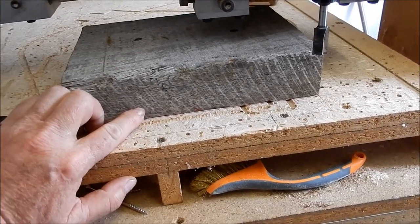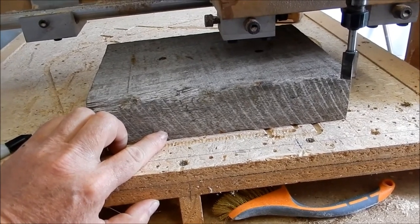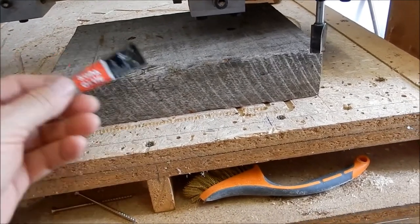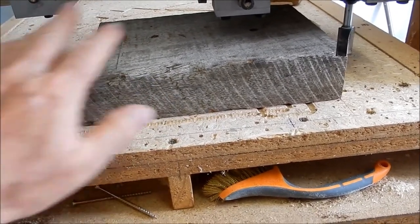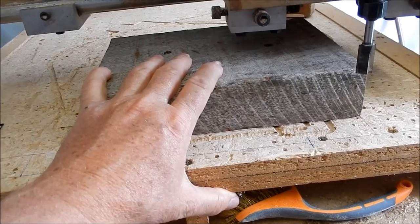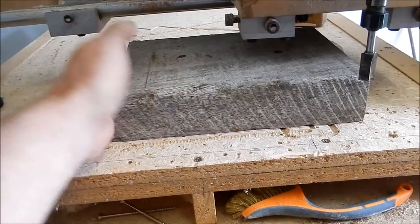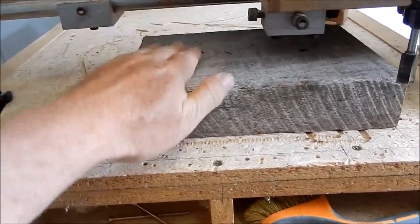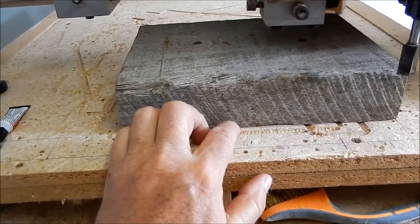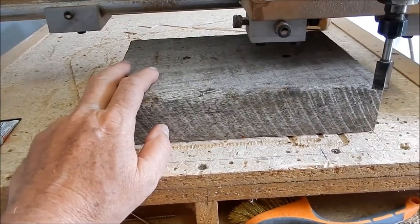But in the floor of this, when it's finished machining, I've only got around about 5 millimeters of thickness, which isn't enough for me to be able to get fasteners on. So what I do on my waste board is I use the super glue and I glue that down and put weights on it and let that sit there for at least half an hour before I start. So we're at that point at the moment. So just a little tip as to what I do when I can't get stuff screwed down or fastened down or clamped down. Super glue does a good job, and when we peel this off, it comes off reasonably easy. Just take some little sections of the chipboard out of that waste board when we do remove it.